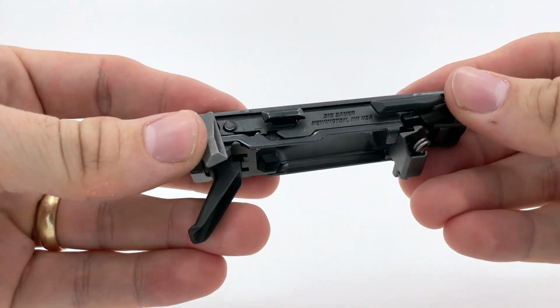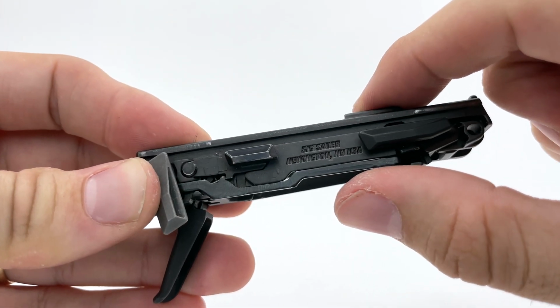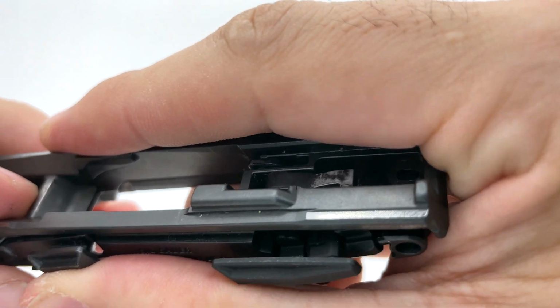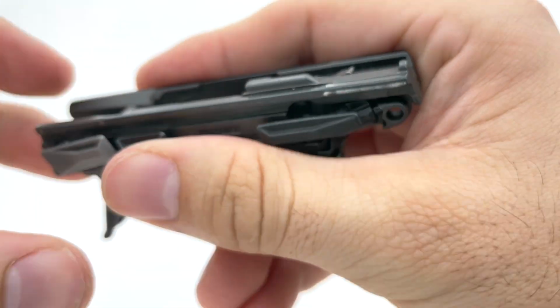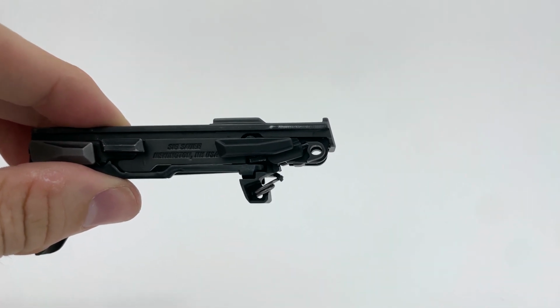Next, in preparation of the disassembly, we're going to lift the slide catch lever to release the takedown from the 6 o'clock position. We're doing this in order to lift the sear back up to its normal resting position, which will give the manual safety assembly the room it needs to be removed from the FCU later on.